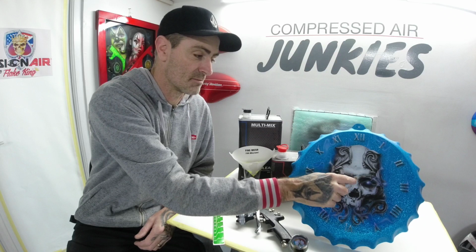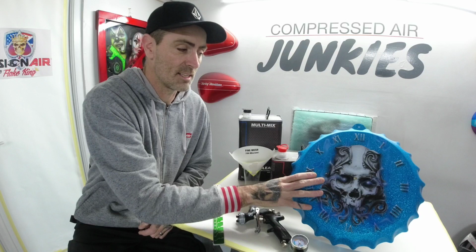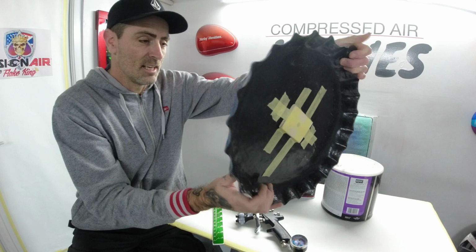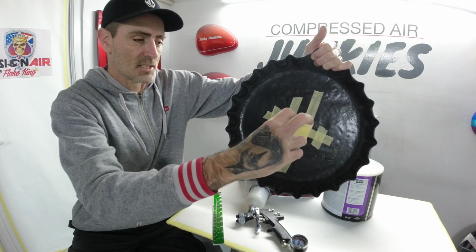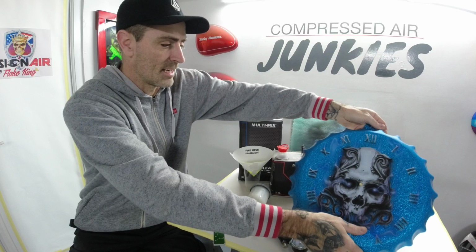And then I cut a piece of batten. You see me do that in the time lapse, and that's a square piece of batten to sit behind this. You see me tape that off, and that's basically a spacer. Because the original clock was thicker, when I pushed the mechanism through on here, you had too much sticking out the front and it made the hands of the clock come right out and it looked a bit weird. So we've spaced the back, glued that on, pre-drilled the piece of timber at the back, so when the mechanism goes on, the actual clock hands sit closer to the body of the clock and it just looks a little bit better. So that one's all good to go, that's ready for clear coat.